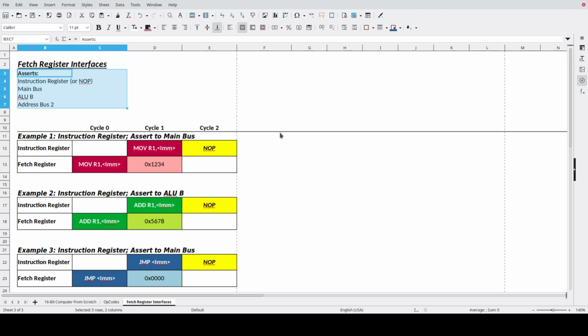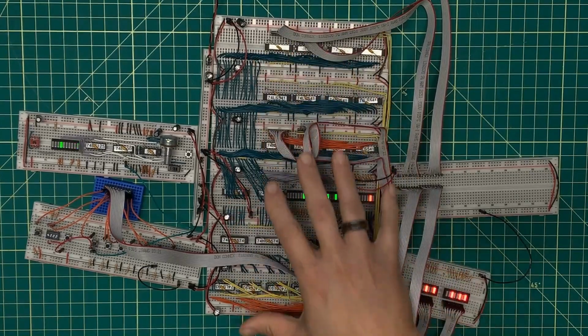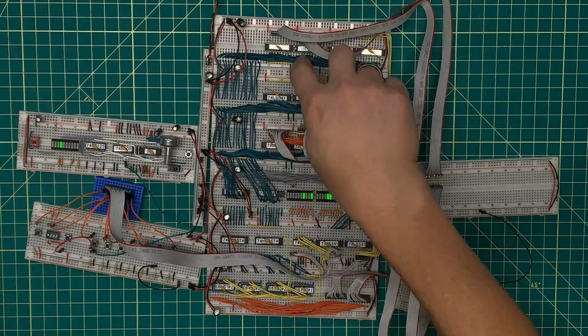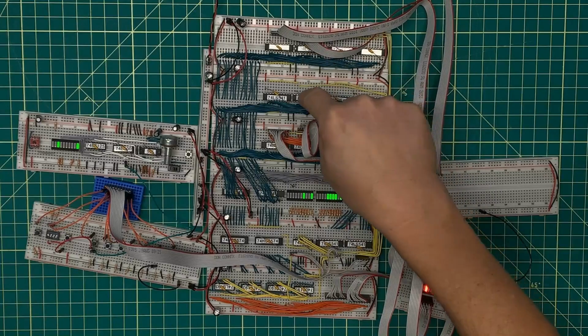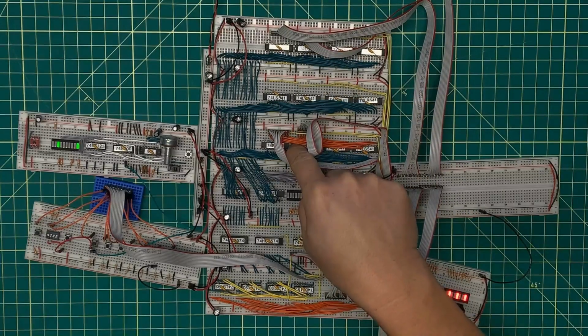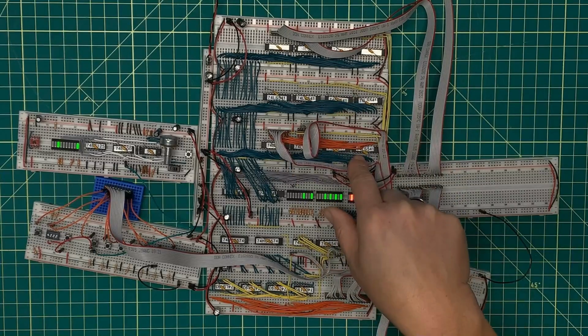And with that, then I can start plugging components into the breadboard. And I'm not going to do that today. In the next video, we'll start putting together the fetch register, which honestly is just a watered down version of this. So I lose some of my asserts. I don't need to assert onto address bus 1. I don't need to assert onto ALUA. I don't need to assert onto the swapped main. So I only have 3 asserts there.